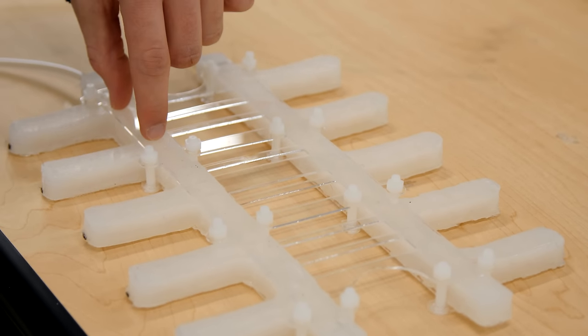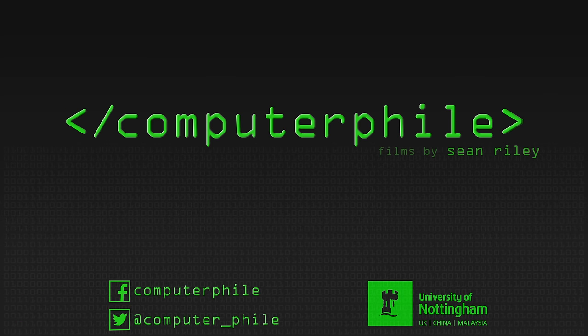We use fluid and electrical circuit analogies where you can model each segment of the robot as a fluidically resistive and fluidically capacitive region. If I assign a certain value to that, I can map out the amount of time it would take the fluid to reach that part of the foam when an impulse of pressure — air or water — is sent. The final goal is to use that automatic design synthesis program to specify the robot's shape, its inlet, outlets of pressurization, and the desired sequence of actuation — whether for a swimmer or a crawling robot — and use a foam structure with a single inlet pressurization source to achieve that sequence.